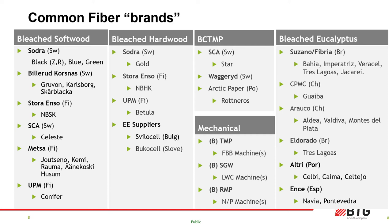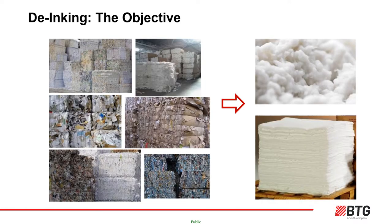Other natural cellulose fibers are sometimes used for paper making, such as cotton, hemp and other grasses, where there is an abundant resource. We also have recycled fiber. The properties required for the initial grade of virgin paper now being recycled will determine the fiber makeup of the de-inked pulp. Generally the de-ink pulp is a mixture of all the fiber types we encountered previously.